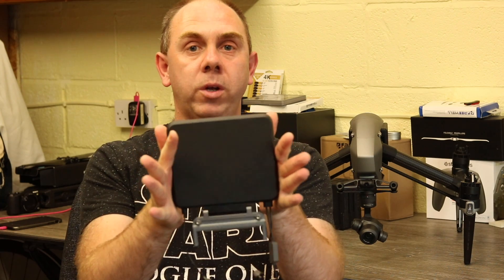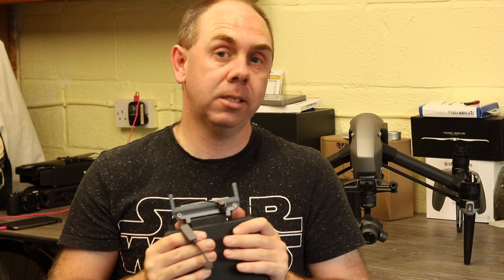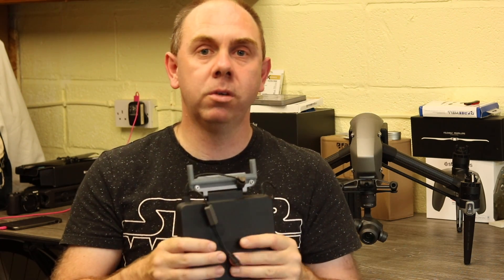As you could see, the patch antenna directivity is approximately 60 degrees either way off centre, giving you 120 degrees of overall field of view. When it does fall off, it falls off like an absolute cliff — full signal, full signal, then it stops completely, and the smallest turn back and it reconnects. You do need to make sure you are pointing within that 120-degree field of view, ideally straight at the aircraft. The same 60 degrees applies on the vertical axis as well — think of it as a circle of 60 degrees all the way around the aircraft that you need to stay within for the best signal.